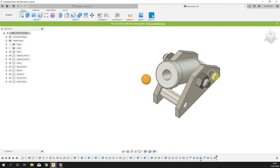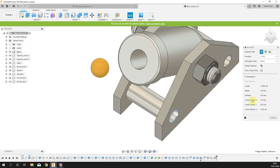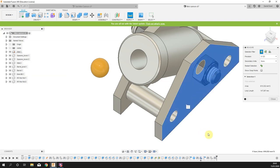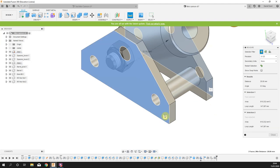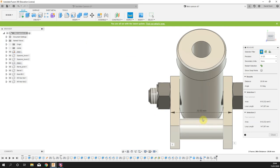Four more fasteners to do. Measure the bolt hole — it's a four millimeter diameter, so we want an M4 fastening. Measure from face to face: it is 20 millimeters all the way across. Ideally the bolt length would be 10 mm, but to avoid bolts touching in the middle and not fully seating, I'll go for an eight or nine millimeter bolt.